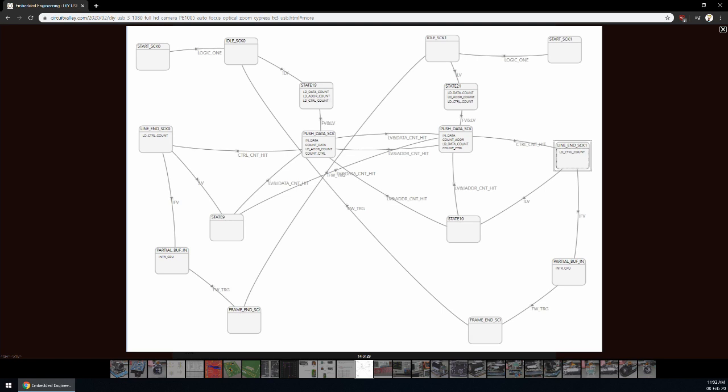next line. As soon as the next line appears, it comes back into the data capture state and keeps on capturing data till either the fixed number of pixels for this particular line has been captured, or the thread DMA buffer has been filled. If the DMA buffer has been filled, then it will move to another thread and repeat the same operation as long as the line is valid and the pixel count for this particular line has not hit.